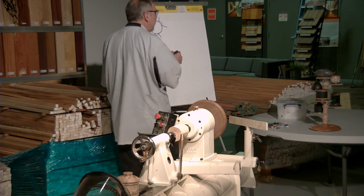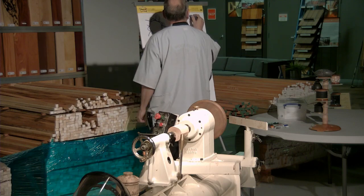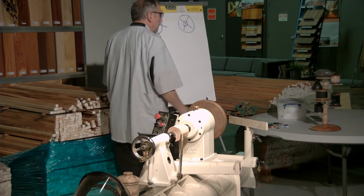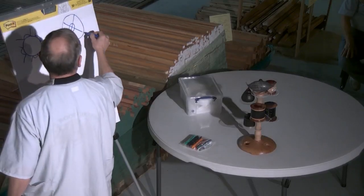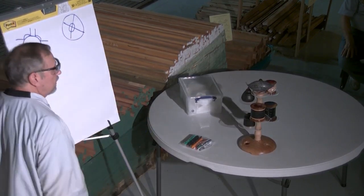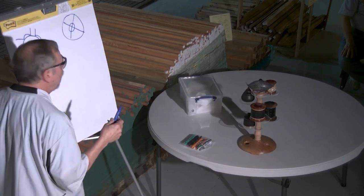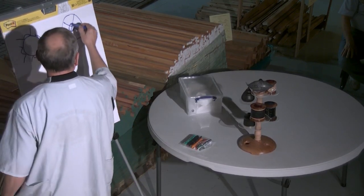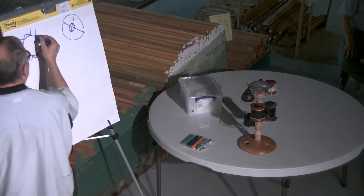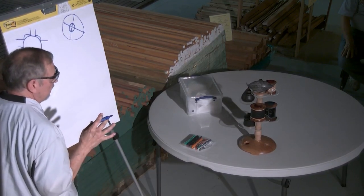the reason they're doing that is because these jaws were started out that way. They machined them this way, and they cut them. So with a kerf right here, if you put a 16th of an inch kerf in a set of chuck jaws, and I don't care who makes them, they're all made the same way, you're gonna find that that's a perfect circle. The most contact you get on here is where it's gonna fit the best in the round.